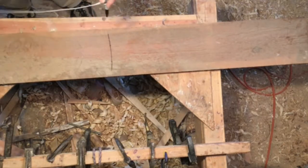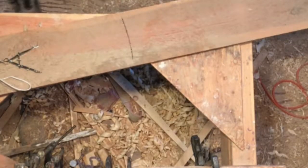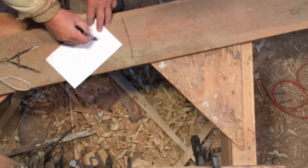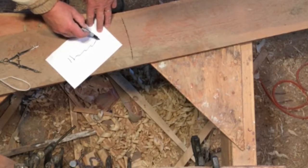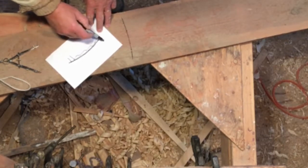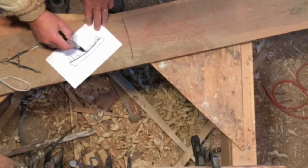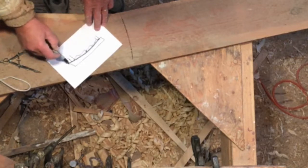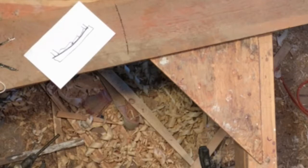They're a little flatter. What if you need an arc that has a radius of maybe 200 feet? Well, let's say we're going to pour a sidewalk. We put our forms in, pour the cement, and then we wanted to screed this with a screed board that had just a slight convex curve so that the rain would run off the driveway — maybe one quarter inch of curvature in an eight-foot driveway. The radius of this arc might be several hundred feet long. We'll show how to calculate that later.